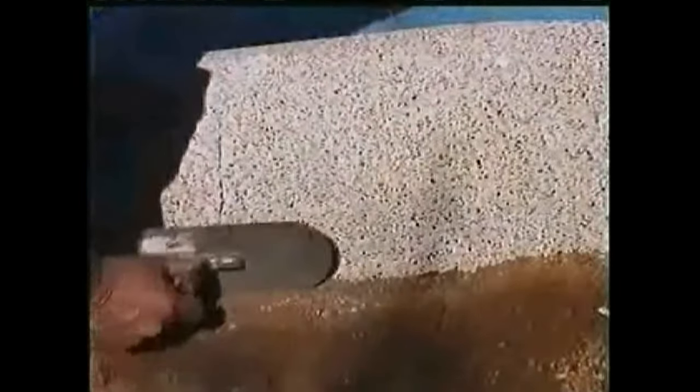Here we have a rolled bond beam pebble plaster repair. Remove dirt and rock from the bottom area to expose it. You will usually find clumps of excess pebble plaster there. This excess from the original installation of the pebble plaster has to be removed because it is the main cause of hollow and cracked pebble plaster on the rolled bond beam.